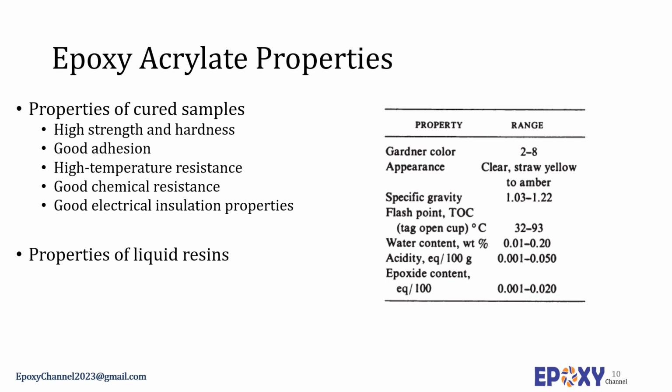The chemical resistance of epoxy-based methacrylate vinyl ester resin is higher than epoxy-based acrylate vinyl ester resin, as it has been said. And the excellent acid-base resistance of epoxy-based methacrylate vinyl ester resin is attributed to their low ester content, the protection of the ester linkage by the adjacent methyl shield, and the steric hindrance of the co-reactant, usually styrene.